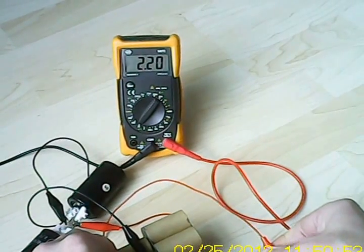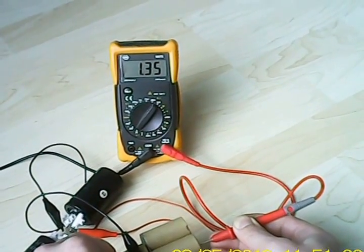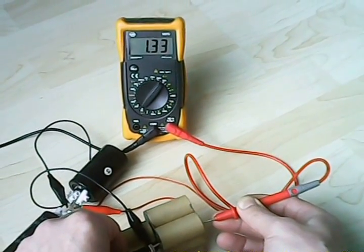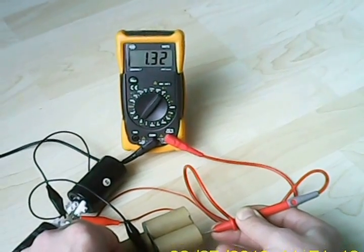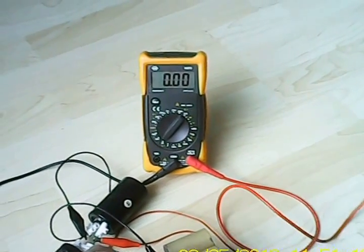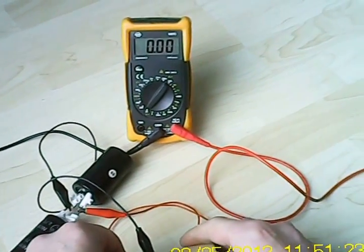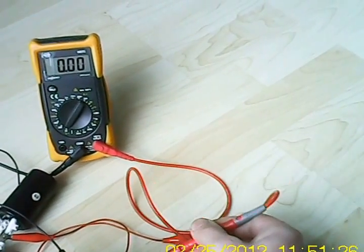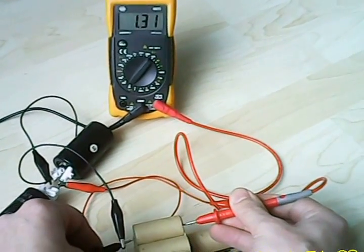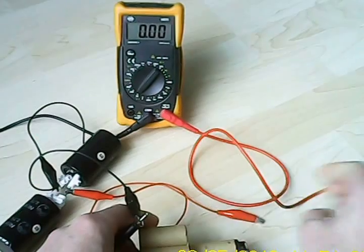Let's keep some power in the caps. Let's see what happened with the charge. This is what I aim for. It started out as 0 volts because it didn't want to keep a charge, and now it is over 1.3 volts. Which is a nice standing voltage to be at. But most of these cells will drop to 1.2 volts, so that is not too strange if it is going to be lower. I am just only boosting it at the moment. You could see it maybe in a flash — 1.31 volts. And believe me they were 0 when I started.